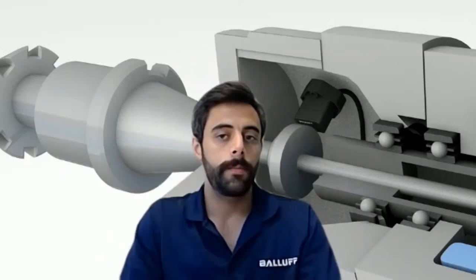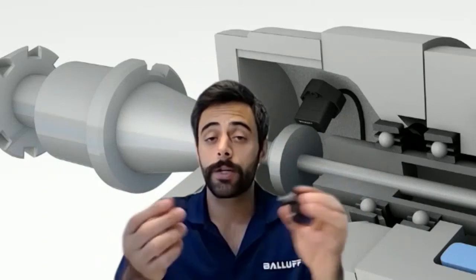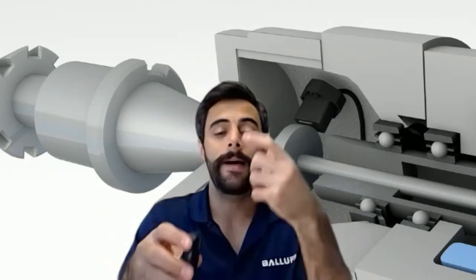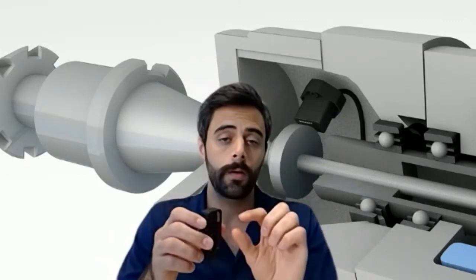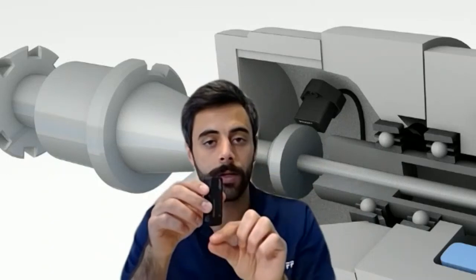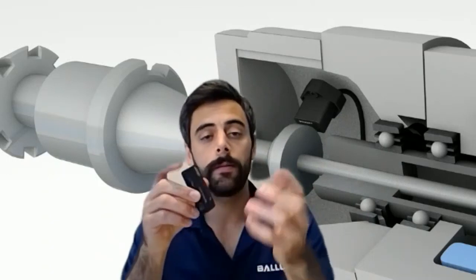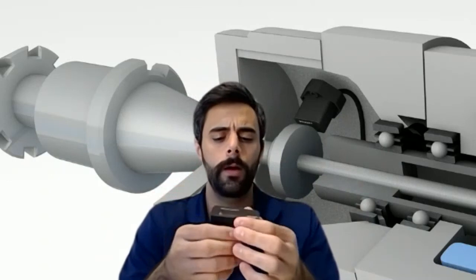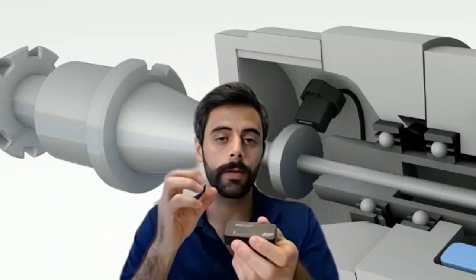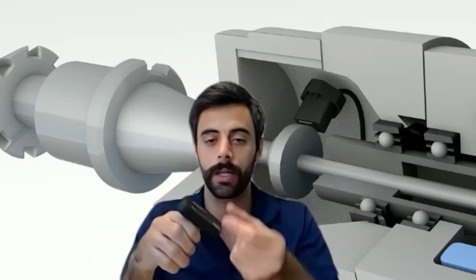The same concept applies to an actuator. If you needed to know the position of a pneumatic actuator or a valve position, you could install this on the side of the actuator and then have a ferrous target at the end of that actuator to give you your position feedback. I've also seen this used for measuring whether or not a robot gripper is gripped or clamped — which goes back to positioning that actuator.